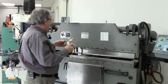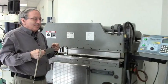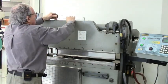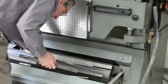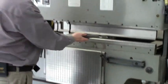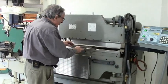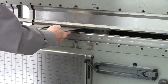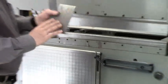If you don't want a sharp bend and you want a radius bend, all you have to do is bend first a piece of scrap and use it to give a radius to the die. Sometimes just for aesthetics you like a radius end, so you have a whole set of radius tools. It's a good idea to put magnets in them so they stick. So if I want to bend this with a radius, I'll just put it in here, and it will give you a rounded bend.